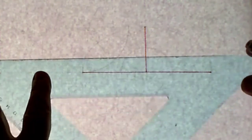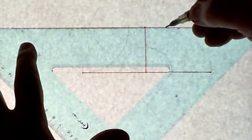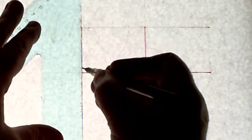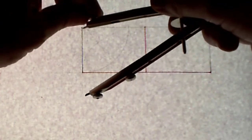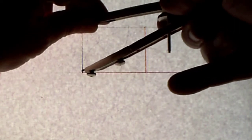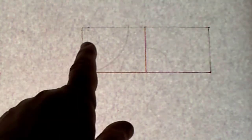Okay, so if I draw simply again the rectangle outline. Okay, so the rectangle drawn in, this is the rise, this is the span. Now, what we do is we get the rise measurement, and we pull it around from that point there onto the top of that rectangle there. The rise line point, okay, this line here.